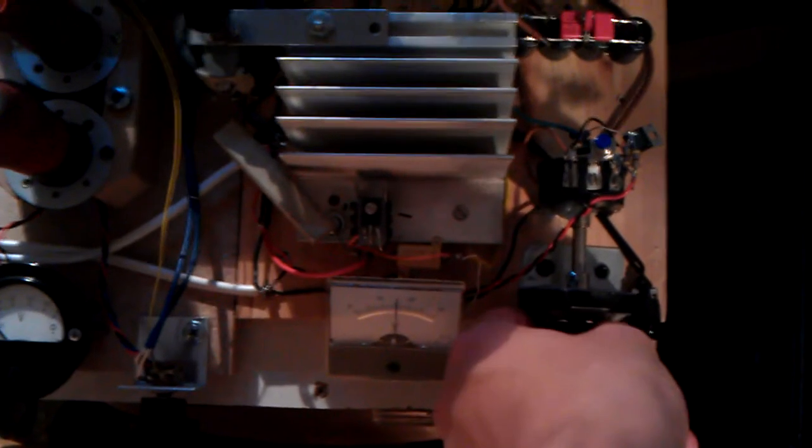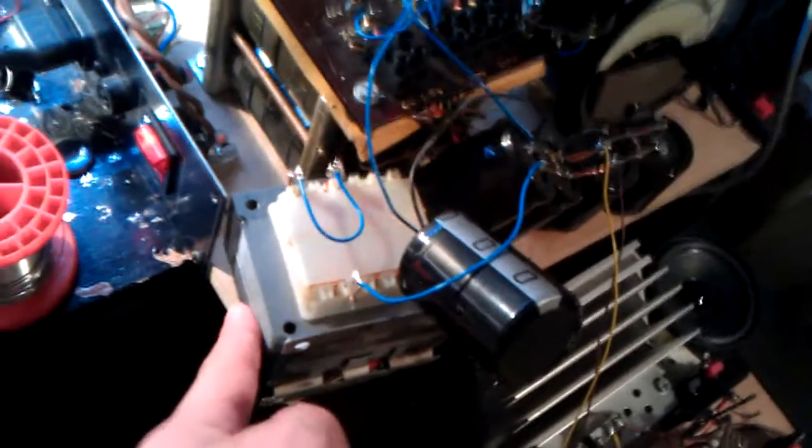And to get this hum free I had to make a little LC filter. I'm just gonna bias the amp here a bit, it's drifting a tad. There we go. So, DC comes here, goes into a 560 microfarad cap, going into about a 150-200 volt amp transformer. We're using the primary winding as inductor, secondary shorted, because this transformer's purpose is to short out AC. It's also got a welded core, which is dampening that even more because it's poor in terms of efficiency. So it's really bad at AC, but it works well on DC.